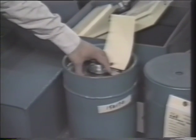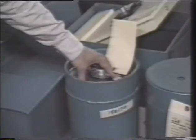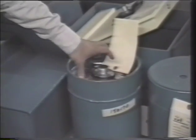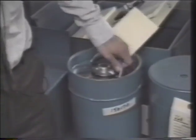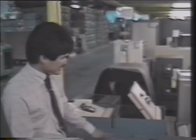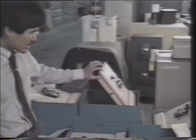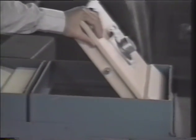Before, this type of safe by another company allowed one to take a sledgehammer. If you hit this area hard enough, all the bolts would break and allow the head to open. The majority of these safes that we've described for convenience stores are burglary-resistant safes. If you were to look at the door, you can see instead of the gauge steel we're talking about, we are now talking about 3/4 inch, 1/2 inch steel. This is 3/4 inch mild steel.